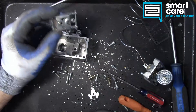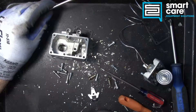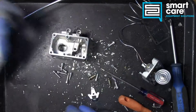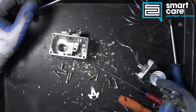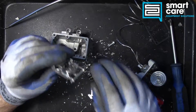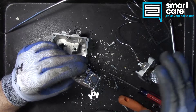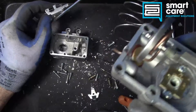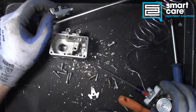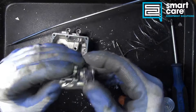Let's talk about the principles we're using. We've got a sealed space with fluid in it, and we're using that pressure ratio to expand our bellows and change the amount of pressure we're putting onto our thermostat assembly. We've got threads in the bottom of the bellows assembly that allow us to change the amount of pressure we're putting on it by turning. So when we turn the knob, that just changes the amount of pressure on that bellows.